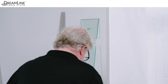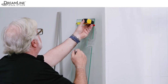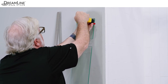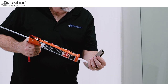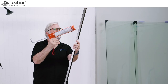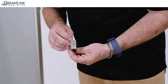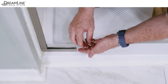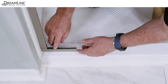Place a mark at the top and bottom of the hinge panel glass half an inch from the outside edge. This indicates the point of maximum adjustment for the panel glass in the vertical U-channel. Apply silicone in the screw holes and to the backs of the U-channels and the hinge panel glass bracket. Install both U-channels and the hinge panel glass bracket using the provided screws. Place two-inch sections of the PVC glass spacers in the bottom U-channel over the screw heads to protect the bottom edge of the glass.